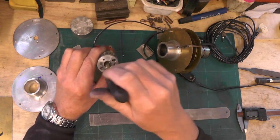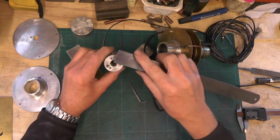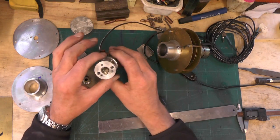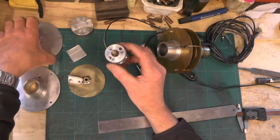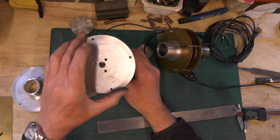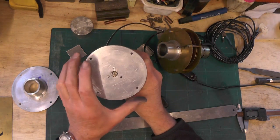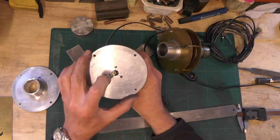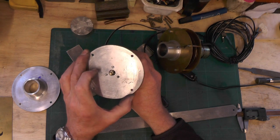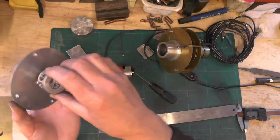Then in this other side of the body you want three equally spaced holes — I've put them on a PCD of 7/8 inch diameter, though that's not critical. That's to fit the backing plate of the impeller onto, like so. I've used 4BA countersunk head screws to fit in them to attach it to that body.